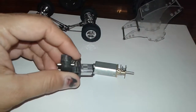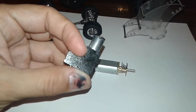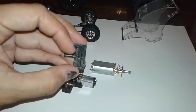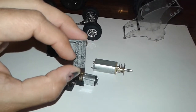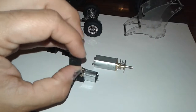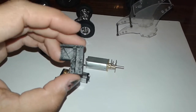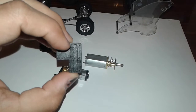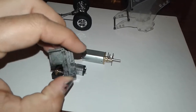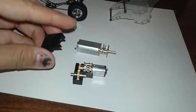For this transmission I made tiny little holes - six little holes right there. They're marked to be one millimeter but once you print it, with a little printing on the side and all that, they come out to about half a millimeter. That's alright because you're gonna need really skinny screws to go in there. There's not a whole lot of room to play with because of the spots for the bearings. You'll use something really small, like the little screws you get from taking apart servos - you can put that in there and it'll hold.